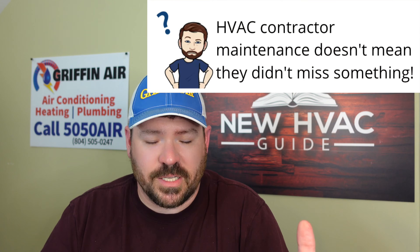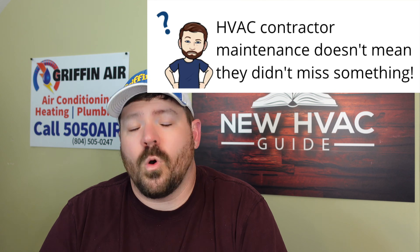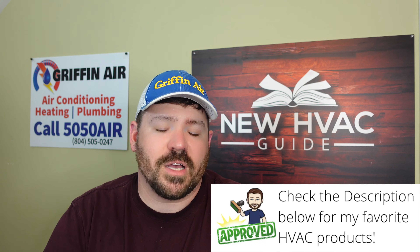So what do you do if you're the homeowner? Ultimately you just need to know what you have. If you can get to wherever the system is located physically from time to time, just visually check it — make sure it's not rusted, make sure it's not been stepped on and broken. Or maybe it's worth paying a little extra money and getting one of these more expensive fiberglass or heavy-duty type drain pans that can withstand someone stepping on it and have no metal to rust.